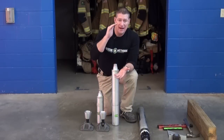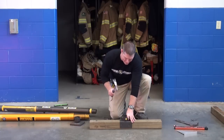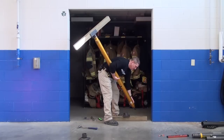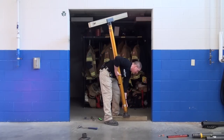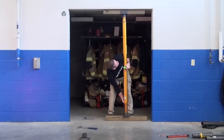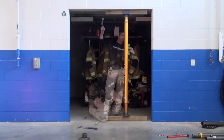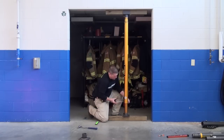Once we've got that known number of what we want lengthwise, we can assemble the shore. We can pre-nail the base plates to our headers and soles and simply walk the shore into place, get it upright, lightly pressurize it, then put our levels on it, ensure that it's plumb, and then finish pressurizing it. We'll go through that segment step by step.